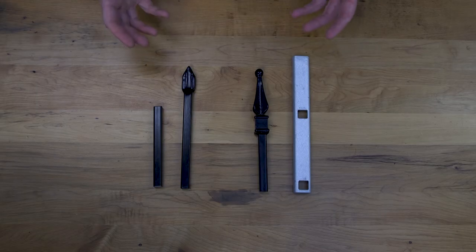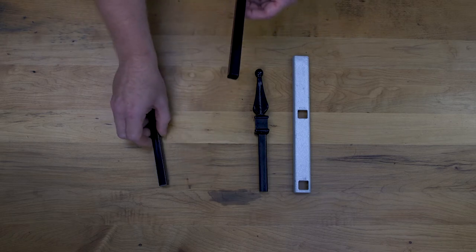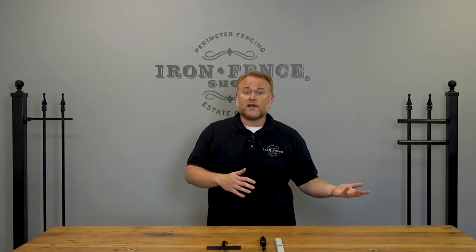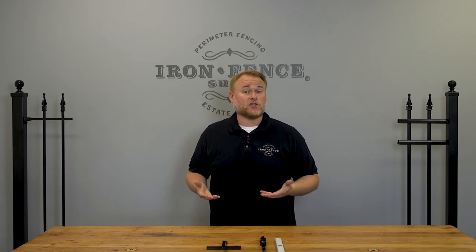Let's start with the punched rail construction. What a lot of competitors do is called a layover or railroad style of construction — they take a horizontal rail, square stock or flat stock, and weld the pickets on perpendicular to the back of it. It gets the job done, but you end up with a fence that looks okay on one side and has exposed welds on the other. Beyond looks, it can also be a very weak construction method, especially if the rails are made of thin flat stock, giving you much less bend resiliency. If enough pressure is put into that panel and the rail bows outward, it can at worst fail completely and fold in half.